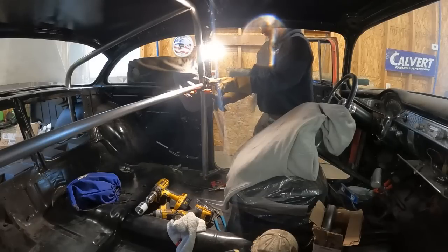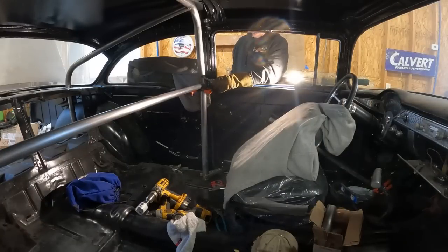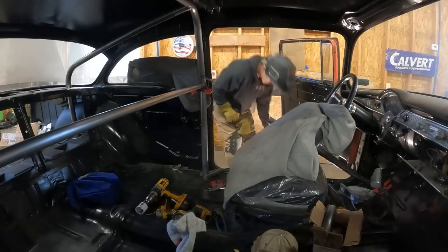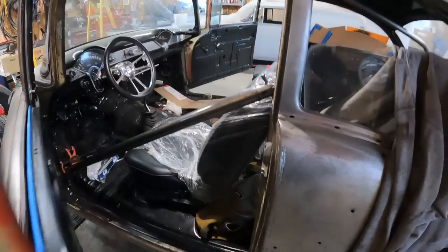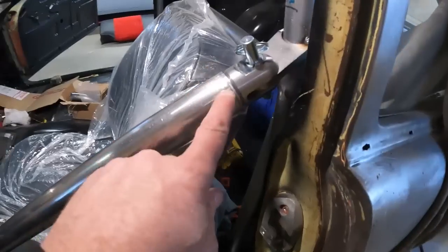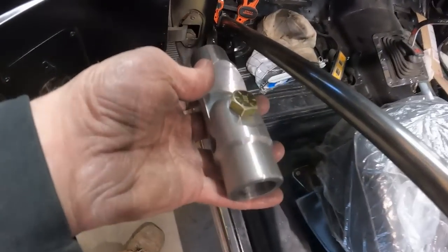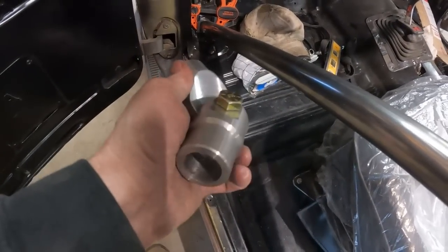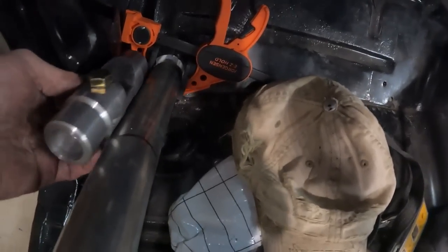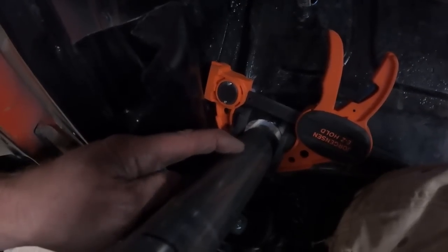It's going to miss the door — hopefully there's still room, and it looks like there should be plenty. The door bar is just sitting there. Got the tab tacked in place, had to open this up just a hair to get the end to fit in there, and we're going down through the hole. This is what's going to be at the bottom of the door bar to make it swing out. I've got a mark on the bar where I want the joint — the measurement from there to there is three and a half inches, so I've got to measure three and a half inches and put another mark. That will be the mark where the curved bar from the frame has to come in.